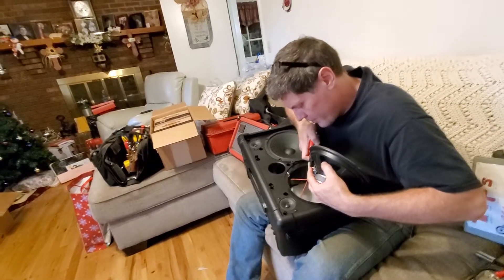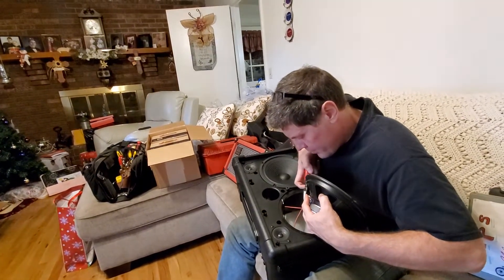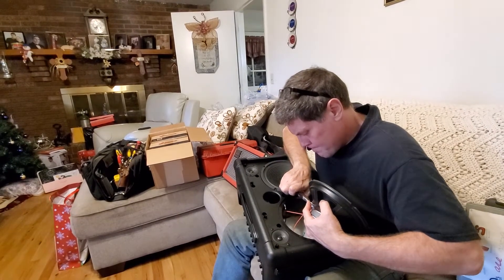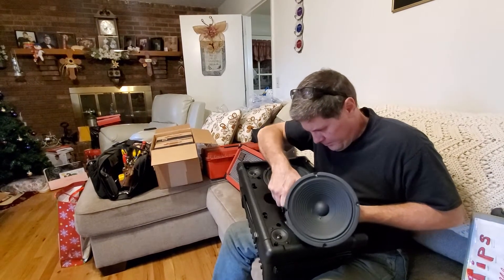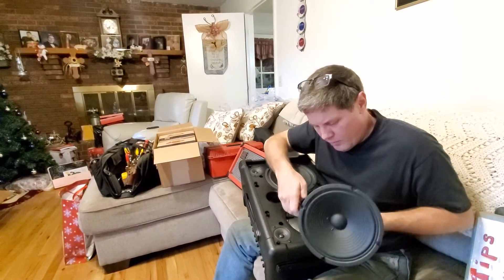The wiring is just red and black. They're really on there tight — need a little pliers. Can you feel the difference in weight between the two speakers? This one is very heavy. It has a pretty big magnet on it for the size. The Jensen speakers have a bigger magnet because it's a weaker magnet — so they have to make a larger one.